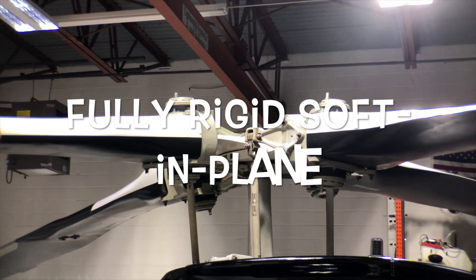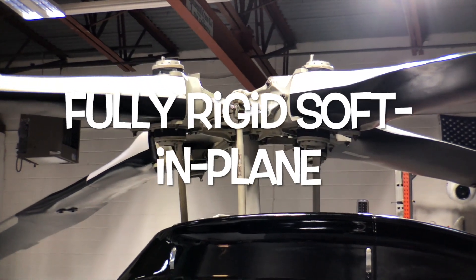These three types of rotor systems are actually theoretical. In reality, there are many hybrid systems that blend the fully articulated and fully rigid rotor systems. Some have no hinges but allow for limited bearing movement in the feathering axis — by the way, pitch changing is called feathering. For example, a fully rigid soft-in-plane rotor is fully rigid in flapping and feathering, but accommodates fluid dampers to allow for some limited movement in the lead-lag axis, hence the name soft-in-plane. It's made out of thin fiberglass yokes that can bend.